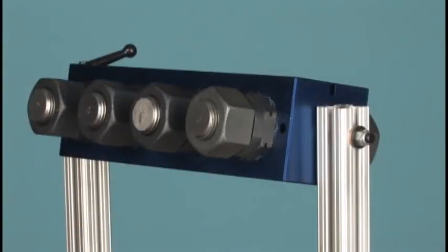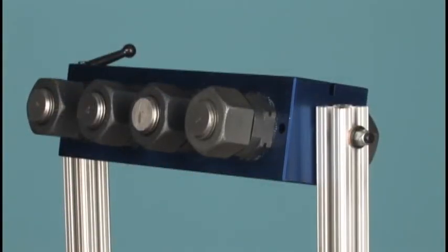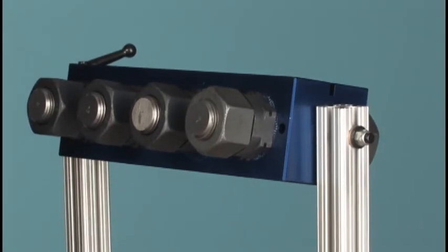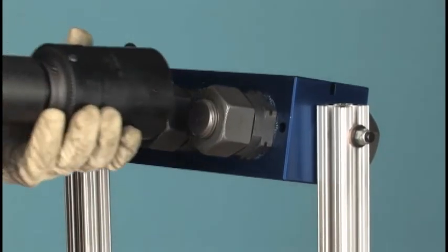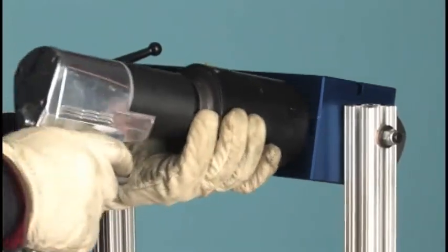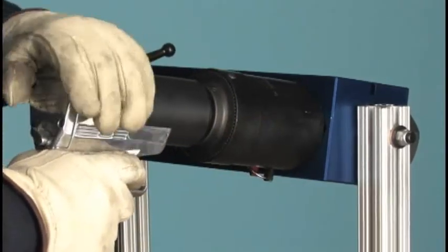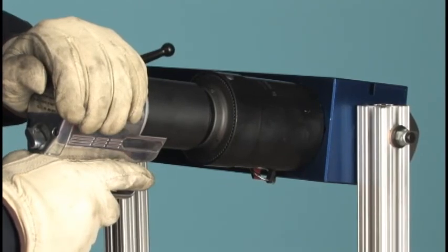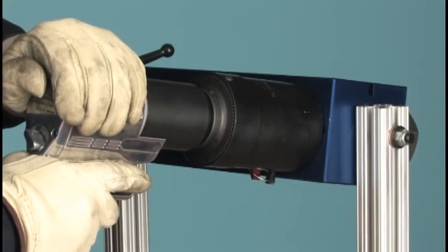The same process and steps apply when using the load disc and driver, except that there is no need to remove or reapply the reaction arm. With the dual drive socket in place, the wrench can be speedily shifted from run down to torquing to run off, all without any danger of pinch points or needing a backup wrench to hold the opposite nut.